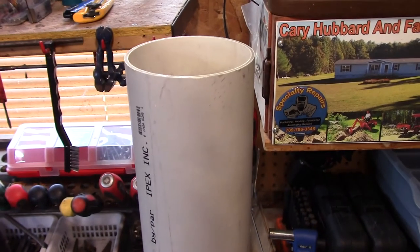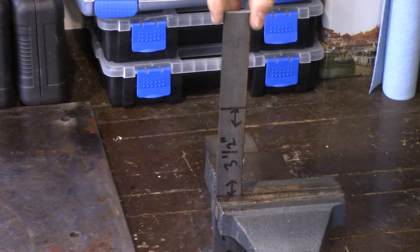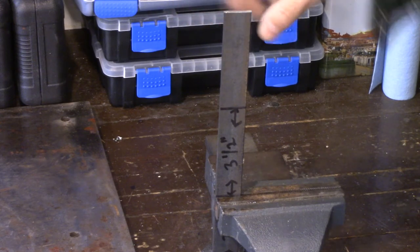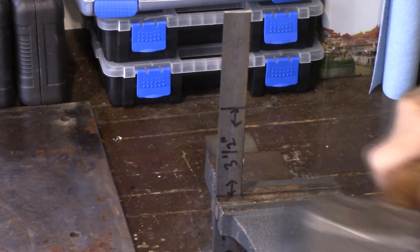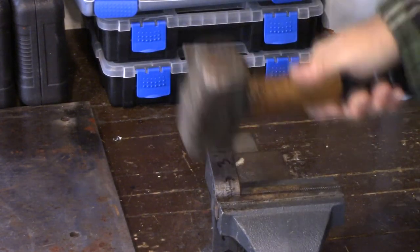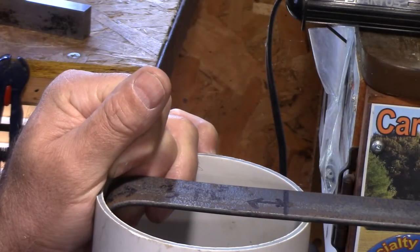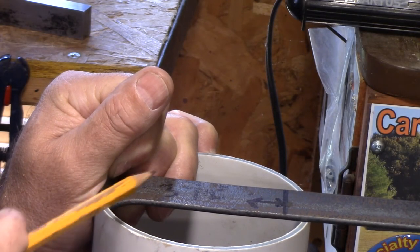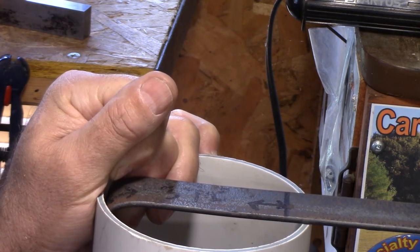Let's get to the top here and bend that piece of metal to fit in there. You set up your piece of steel — this is 1 inch by 1/8 — and I've got it right on my line here for the 3-inch mark. Just bend it down until it's 90 degrees, then we'll bring it over to the feeder and measure up for the next bend. I bent back the first one right on the line at 3 inches. This one here, the line is right there at 3.5 inches, and that's where we're going to bend the next one.